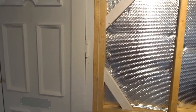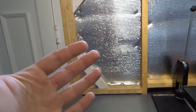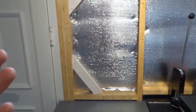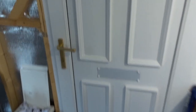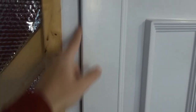Another thing you need to think about if you want to keep your shed warm is sealing up all the gaps. I've wrapped it and sealed it with the tape so there are no air gaps, and then if there are any little gaps - say where the frame meets two parts of the frame - I've just put some sealant down there. I've also got a double glazed door which is much better insulated than a wooden door. Plastic doesn't expand and contract like wood, so you don't get gaps where the cold's getting in - it's a bit like a house.